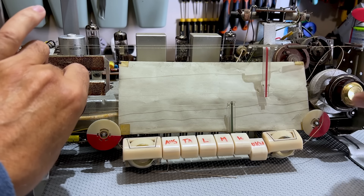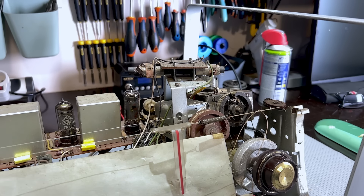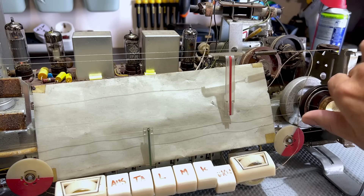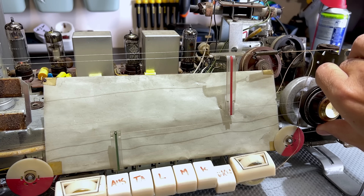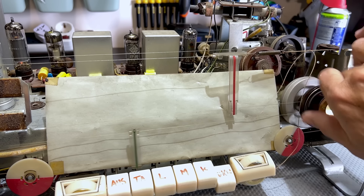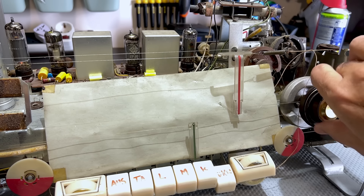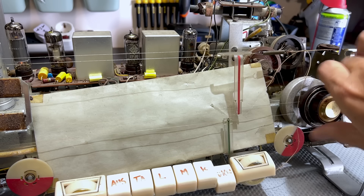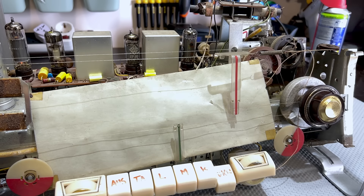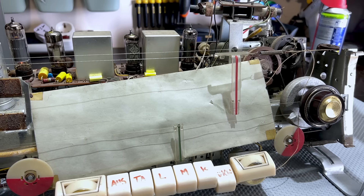The bulb came on and it's dimming. Let's see if we can pick up anything. I can hear some hum. Now the radio is seeing 161 volts because I've only got one light bulb. I'm going to give it another light bulb because the FM section particularly likes to see some voltage — sometimes if the voltage is too low it won't receive anything. Still just a lot of hiss with one more light bulb.